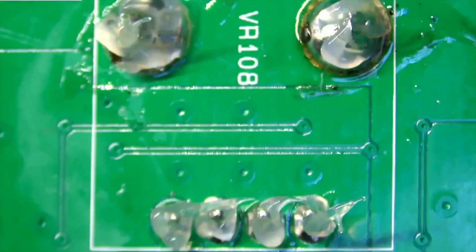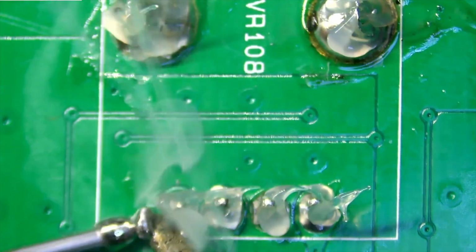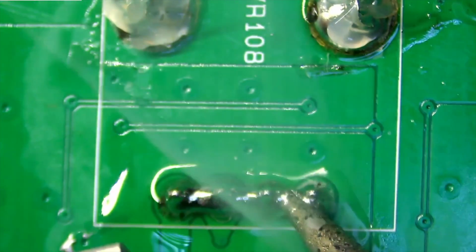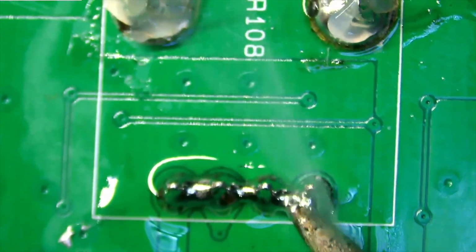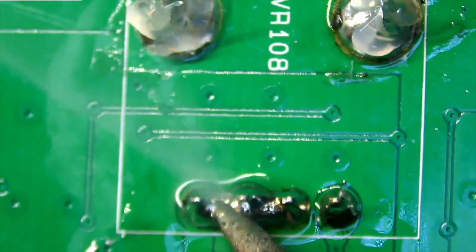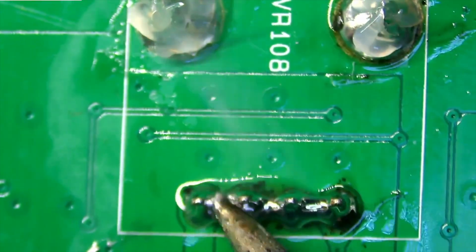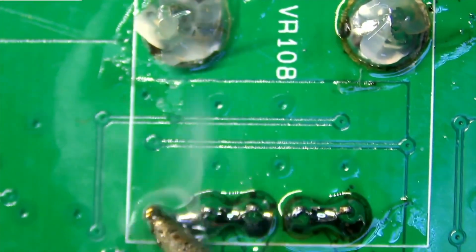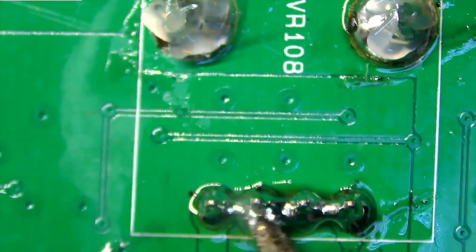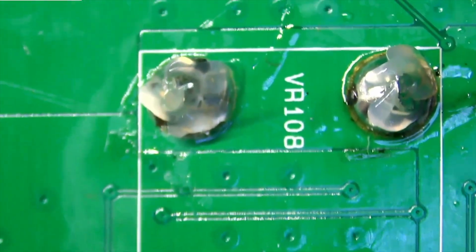We'll slide it up here. Let's see how that low melt solder just went all the way down. You can almost move it just like that. That low melt solder works wonders. I'm not really worried about these connecting, because I'm taking it off, and I can clean once I get everything off. I just want to make sure it gets hot enough and that each of these pads is hit with that low melt. And here we go.